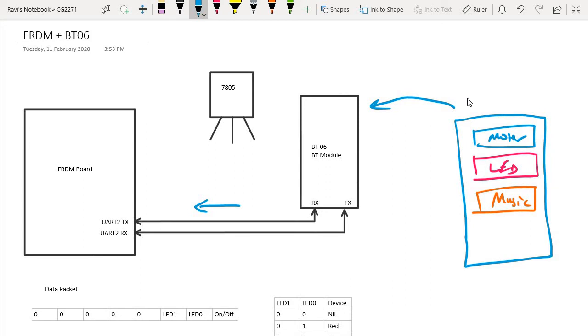To fulfill this, we need to make sure that the hardware as well as the software interface is set up correctly. Let me first focus on the hardware aspect. The BT-06 module needs a voltage greater than at least 3.6 volts. The Freedom board's voltage supply pins are mostly 3.3 volts. There is a 5-volt pin, but when I tested it, I found that the current drive is not enough to power the BT-06 module.